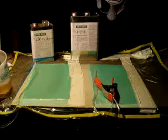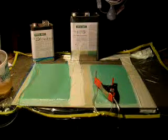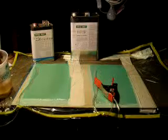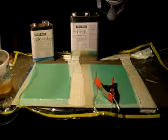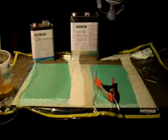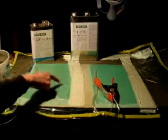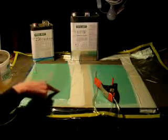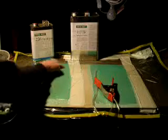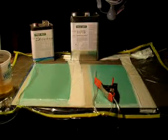What you don't want to do is have Resin flow too fast, because if you flow too fast, you can actually trap air bubbles inside your parts, which for cosmetic reasons isn't very good, and also for structural reasons. You can see I've flowed Resin all the way to here, and you can kind of see the darkened outline of where the fabric has saturated. We're relatively bubble-free — it's a good bag.